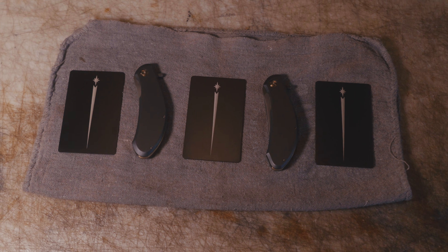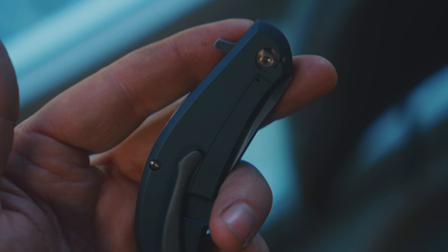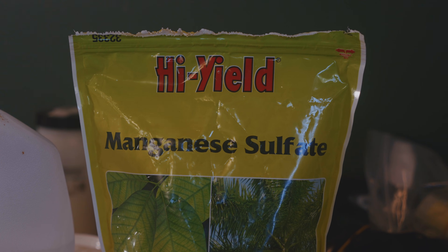For those of you who watched the first video on doing this Tonto, thank you so much. I'm going to be finishing this in the next video — maybe finishing it, at least getting a lot of the handle parts fit up. But for now, I wanted to answer a bunch of questions I've gotten about how do you blacken titanium. I've been making these Astra folders and blackening the handle scales because I think it looks really cool. I learned you could do that from a guy in France named David Lespect, who turned me on to this chemical. It's a fertilizer you can mix in distilled water and electroanodize your titanium black. It's a very nice black — not gray, it's very black.